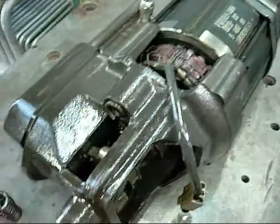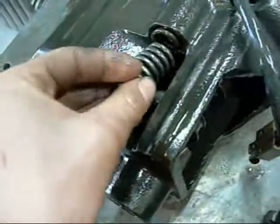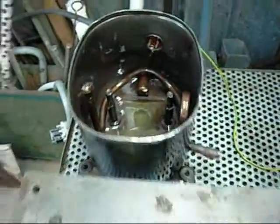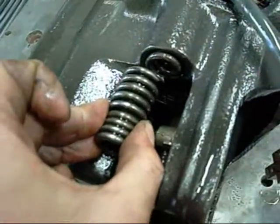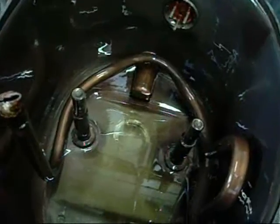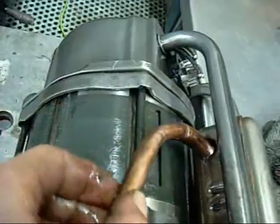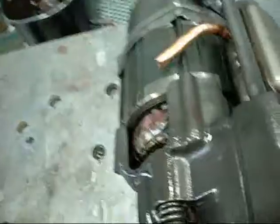I think I've found what I need to complete my autopsy on this compressor. This here would be the first point of failure — the mounting spring. It's reliant on two springs, one on the bottom and one here, to remain central and stable in the housing. What's happened is this one here is shattered, and there's a little rub mark where it's been sitting at an angle — the compressor has dropped sideways and cockeyed in the housing. Hard enough to almost rub through on that crankcase heater tube, and hard enough to bust the end of the discharge tube off inside. That's supposed to be soldered into the muffler, but the vibration and excess tension from sitting cockeyed just busted it off.